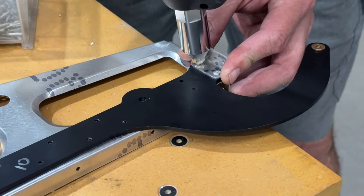One change — I deviated from the plans. They give you a serrated plastic edging material to protect the wiring, but I couldn't get it to stay on. I could have probably glued it with super glue but I was afraid it was going to come loose. So I went ahead and used neoprene foam tape and just wrapped around on the two inboard ribs, just so the edge of the rib won't have any chance of cutting into the cable. Everything else is to the book.